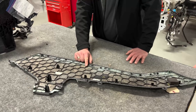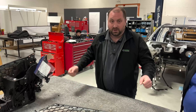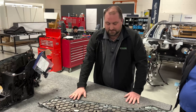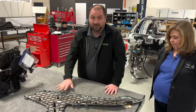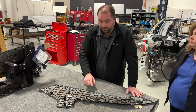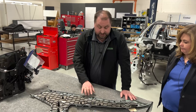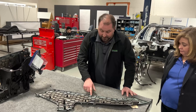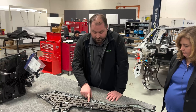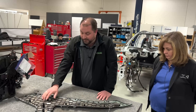Rib to wall ratio for any type of injection molded plastic is a very important thing. Think about a cheap storage shelf or a ten-dollar Tupperware bin — all of the ribbing you'll see on those components sink. You can see lines from the A surface looking like some sort of a milk crate. We want to avoid that on anything interior in a vehicle. We want them to be nice and flat. So if this was a direct injection molded polypropylene plastic, we would say these ribs can be no more than 40% of the thickness of the panel. That causes a lot of interior panels to be 2.5 or 3 millimeters thick just because of how big those ribs on the B-side need to be. But if I compression mold this panel and then overmold the ribbing, I will have no sink read-through. I could very well make a compression molded panel that's one millimeter thick, one and a half millimeters thick, and then put whatever structural ribbing I need.